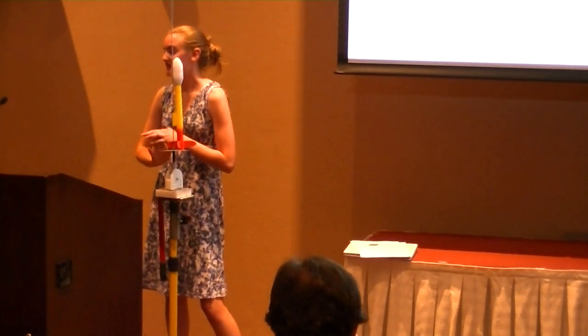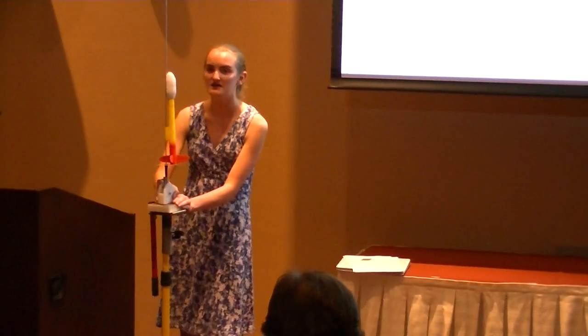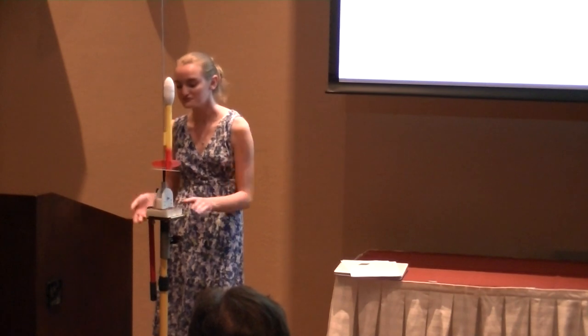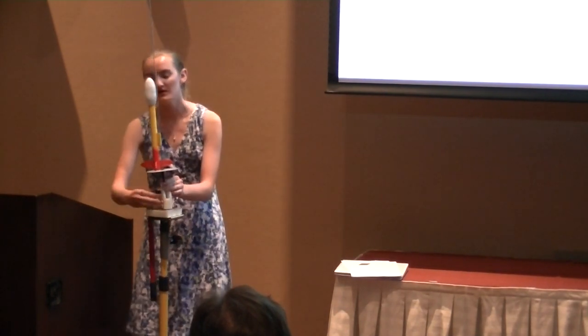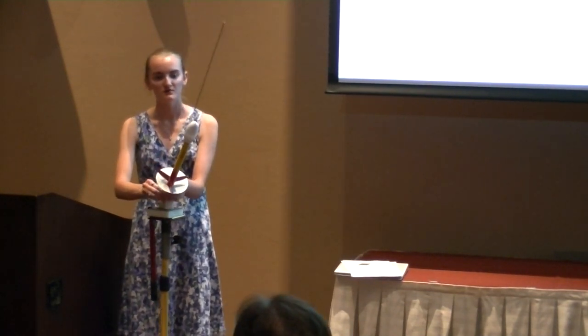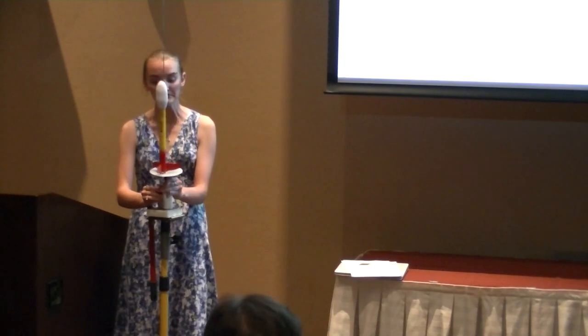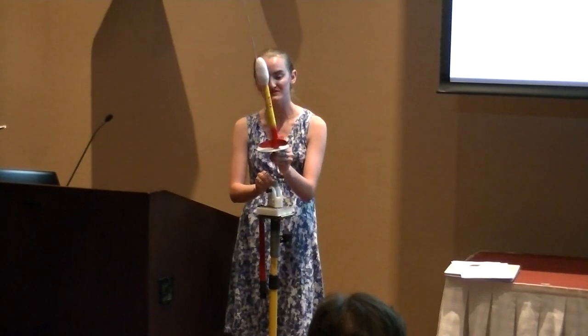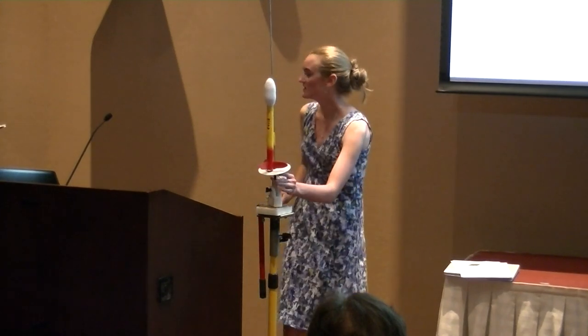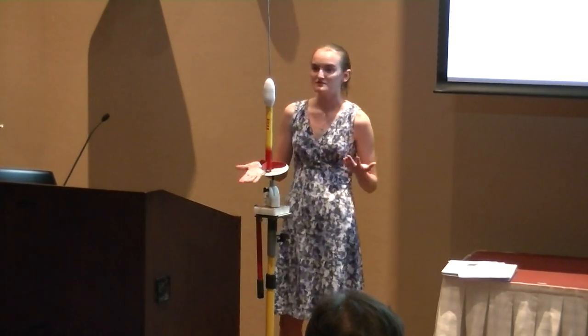It's less expensive, and it can be used in competition because this head can swivel — it's not too hard to do, but it will stay in place once you swivel it. There's also a knob that allows you to tilt the pad 30 degrees from vertical, which is within the allowed amount in the NAR pink book. And there's also an upper section where you can switch out the launch rod, and it will tighten down to a one-eighth inch rod. It's easy for children and disabled people to use because it lowers down to a position where it's easier for them to work with.